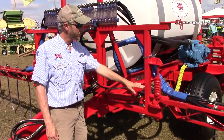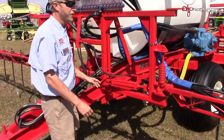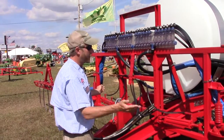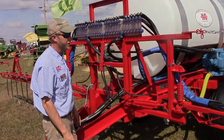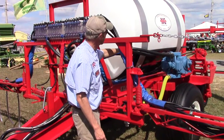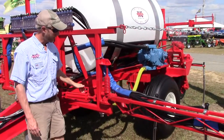These are our hydraulic fold booms. We've got the cylinders here — you just hook it to the tractor. On this particular unit they're teed in together, so when you push your lever on the tractor they both fold in. For convenience, you don't have to get out and put your booms in the racks.